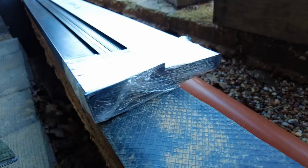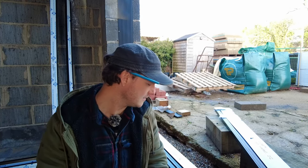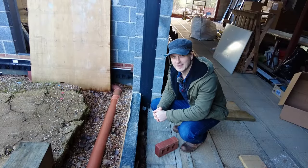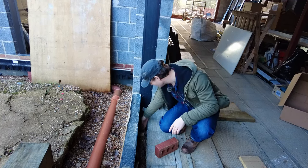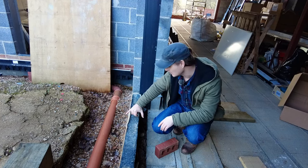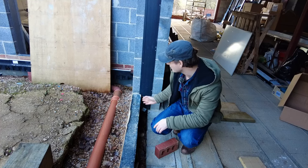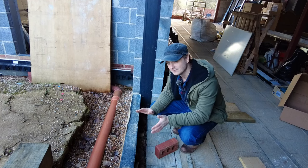So I'm thinking in circumstances like this, window fitters - I don't think that they fit the doors with a 30mm overhang into the cavity. I just can't see it happening. I reckon they do it flush with the brickwork. And in terms of thermal bridging, I don't know, does it even really matter? I'm sure I'm overthinking this, but can you see where I'm coming from? Surely there's a way of fixing this issue down here, being able to set back your seal 30mm and get a proper fixing and also resolve any issues with thermal bridging. But for the life of me, I can't figure it out.